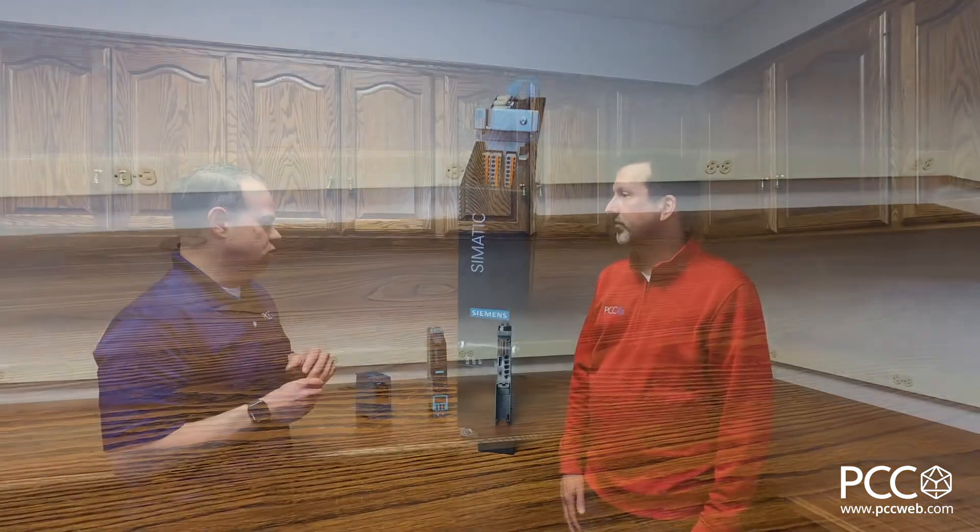This CPU has the capability of handling a certain number of axes. If I need to extend beyond that — maybe double or triple it — can I still synchronize axes across controllers? You can. The S7-1504D is equivalent to say a 1516 tech processor, which handles a certain number of axes, and then the 1507D variant handles quite a bit more — the drive count. And even if you have multiple drive controllers, you can synchronize across those drive controllers as well, or across multiple 1500 CPUs of any kind.